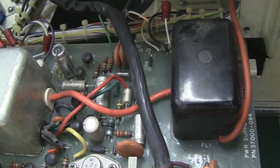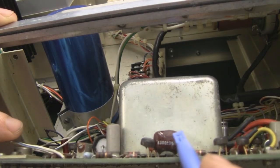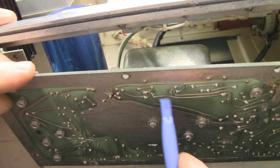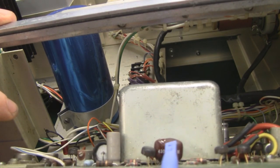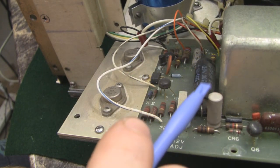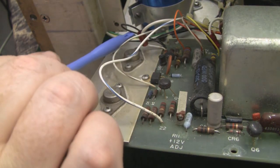Other than the snapped wires, I can't find any burning or tampering on this board — no missing components. However, on the back of the board there's evidence of somebody getting in there with a soldering iron, possibly trying to swap out a capacitor. It's a vintage replacement capacitor, not a modern one, so I'm not sure if it's original or a prior repair attempt. Unfortunately, whoever did it ripped off the PCB traces — probably caused by a soldering iron that wasn't hot enough.